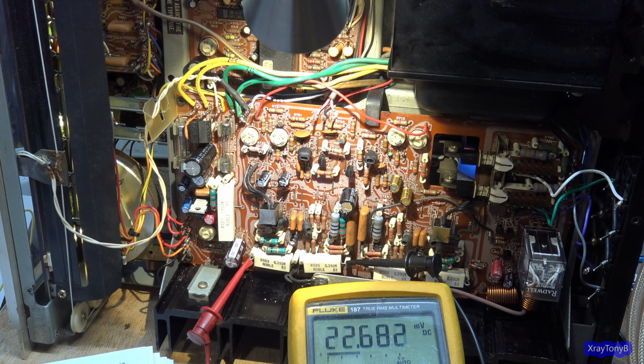And the other thing I'll tell you about that is that the instructions are always going to err on the side of caution. So they're going to set the bias to a level that no matter what transistors get in there during production, you're never going to have any chance of crossover distortion, because it's well above anything you would see in that transistor. So like I said, transistors are all different a little bit one from the other, so that's just to be expected.